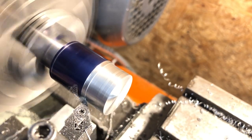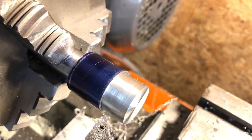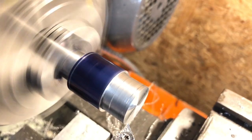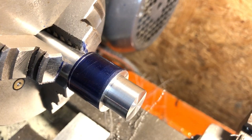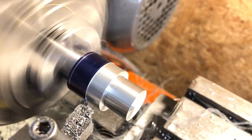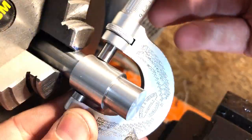Having marked this oversize with calipers and setting a carriage stop, I'm advancing the tool using the top slide, which is set over an angle. This means that it will advance towards the work and towards the chuck. In this way I can approach the length I need without removing the carriage stop. Once I'm within a couple of thou, I can lock the top slide, and continue turning my diameter using the usual controls until I reach my 5/8ths target. I can then run the carriage up to the stop, lock it in place, and take the final couple of thou off the length of the centre section, again using the top and cross slides. With that done, I can take the centre section to diameter — this is to be a close fit on the secondary gear, so needs to be within a couple of tenths of 3/4 inches, but other than that it is a simple piece of turning to dimension.